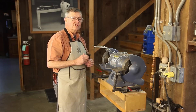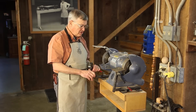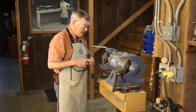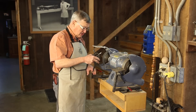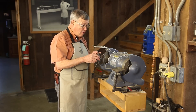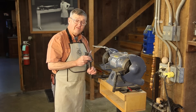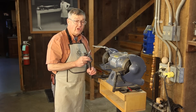The next big step was the grinding jig. The first one was offered by Jerry Glazer. Tim Clay at One Way took Jerry's ideas and made it so it fit on the grinding table, and that's what we mostly all use today. You simply position this Wolverine arm to the right place, then take this Vari-Grind jig and rotate it against the wheel, and you get a perfect grind. Anybody can learn to grind a tool in a very short amount of time and get perfect repeatable results every time.